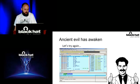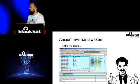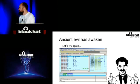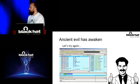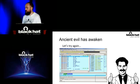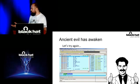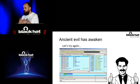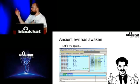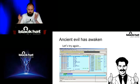You can't expect any more convenient interface to analyze it at runtime. It has all of this. All you need is to dump all this memory, again using JTAG, it's more than doable. Then you use a Python script to correlate your symbol table to the code you are debugging, and you can do whatever.